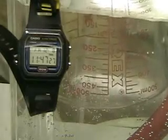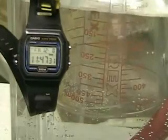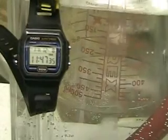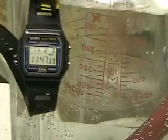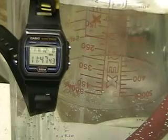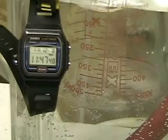This is Hydrogen Tap One. This is a Series 2 unit. We have 11 stainless steel plates in here. We're running on a 12-volt battery with a charger on it, which brings it to around 14 volts. We're running at 30 amps and it has lye in it.